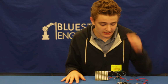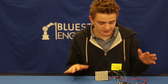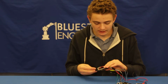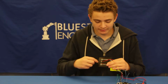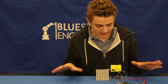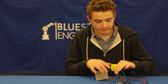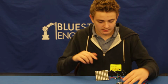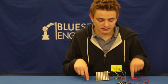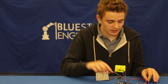So I did actually have a couple of issues when I was building this. For example, when I was trying to film my last video, the wires on the back became unsoldered, they just ripped off, so I had to resolder them back in, and I added some extension wires as well by soldering and taping them. I had some issues with the breadboard, like the buttons weren't fully pressed in, and then I didn't know if the circuit was being completed and was sending the proper input to the Arduino.